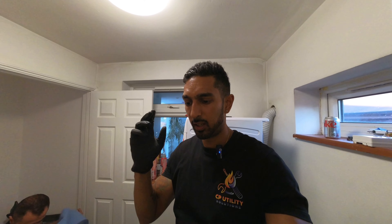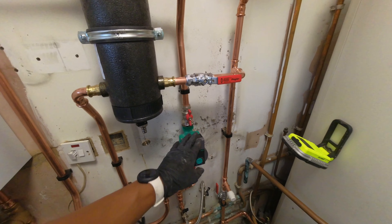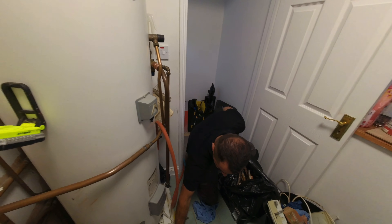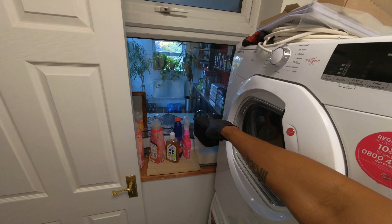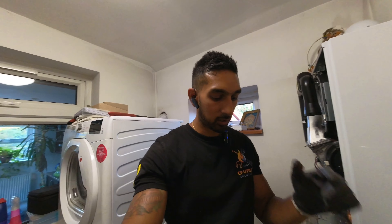Getting piped up today as planned. Let me step back and show you what we've done: system boiler coming down there, got a flying return feeding the low loss header, header side going down, pump — that's an eight-metre head pump — going down there, splitting to the heating zone going down there. Then spotted a crisis — we hadn't tied in the cylinder return. Luckily I saw that during the walkthrough, so just put a tee in there and tied the cylinder return back in. Crisis averted.